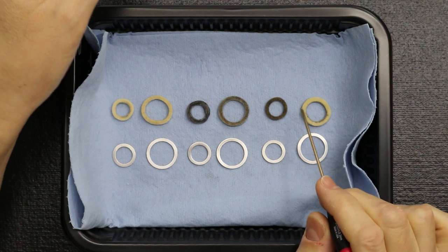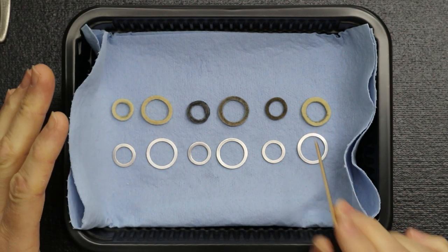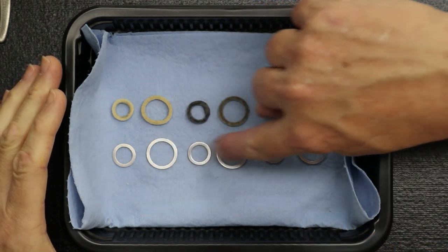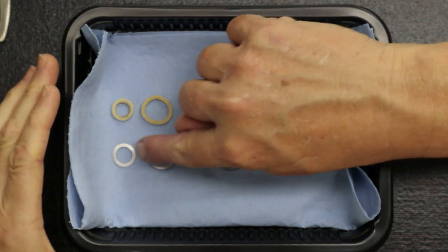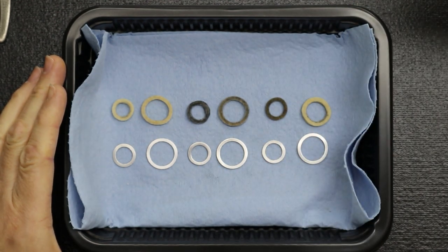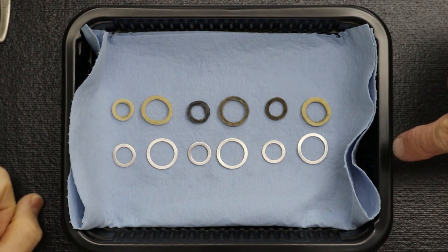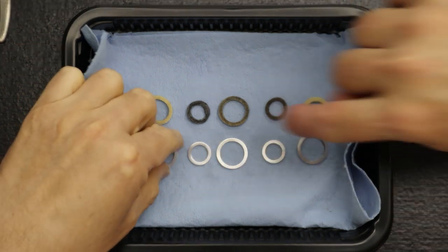Okay. We just wanted, real quick, a couple of observations. Can I share? Then you can go. Oh, sure. I went with the brush finish here on the retention rings. The condition you found, they're all perfectly flat, but you just wanted to clean them up. Yeah, just the flat surface, and of course, I didn't touch the ODs because of their press fits.